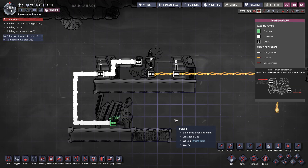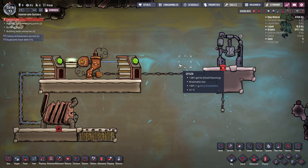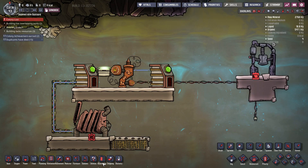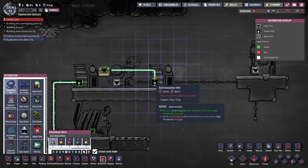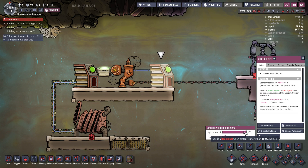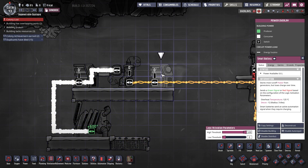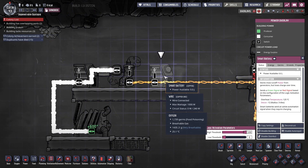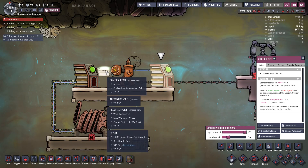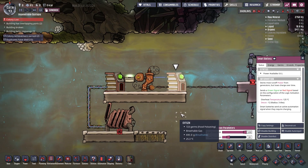So this is the entire circuit now completed. Let's explain what it actually does. As the main battery, which controls the generator, is charging up, it will also charge the second battery. The second battery is directly connected into our circuit — our base. When the secondary battery is charged up to 100%, it will set the red signal and deactivate the switch, disconnecting itself from the main power grid, and will just supply power to our base. As charge depletes to a certain threshold, it will plug back into the grid and get recharged by the primary battery, and so on.